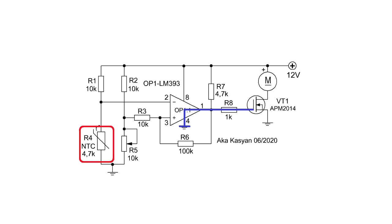When the thermistor heats up to a threshold value, the comparator is turned off, or rather changes the state of the output. If earlier we had a low level, now nothing. It is then that the transistor will work. It will work due to the previously mentioned resistor, which will provide a plus on the gate and will open the transistor. A load is connected to the drain circuit of the transistor.